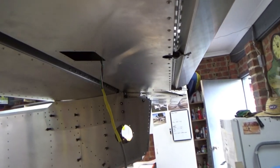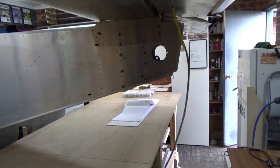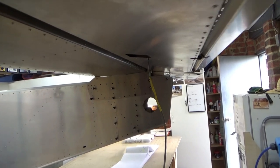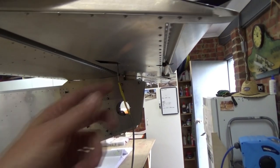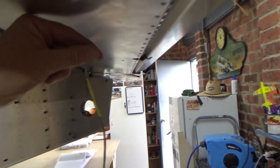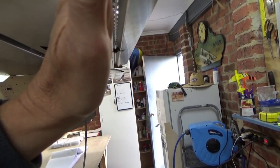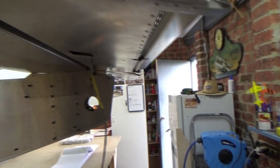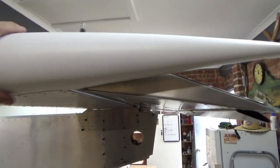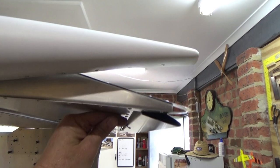It's the grey and white wire in my case — this turns to brown on the supplied cable. But grey and white is power, and just reverse the polarity to reverse the direction. I've set my trim: 20 degrees up, 40 degrees down. About to pull it back out ready for paint. The elevator trim — you just have to play with the length of the rod. The length given is about 116mm through that rod, which isn't quite right in my case. So I adjusted the turns: I went full trim tab down, had the motor at the stop, adjusted the rod so I knew there was no mechanical binding, and set my rod length. That got it spot on. Riveted my tips on — just beautiful, really nice.